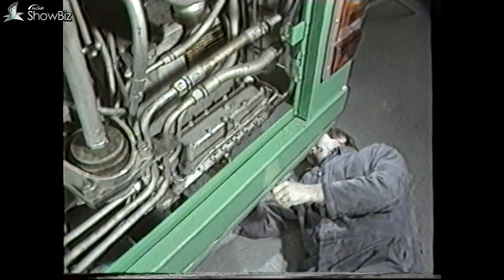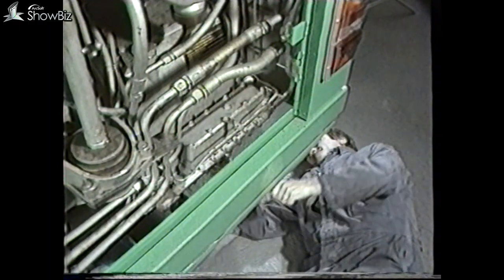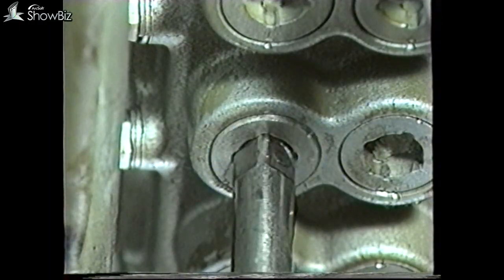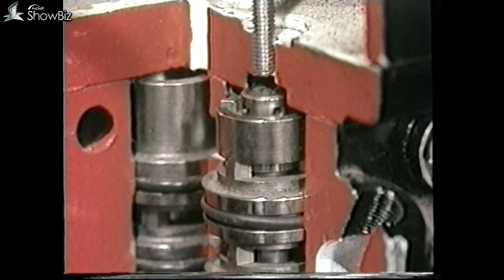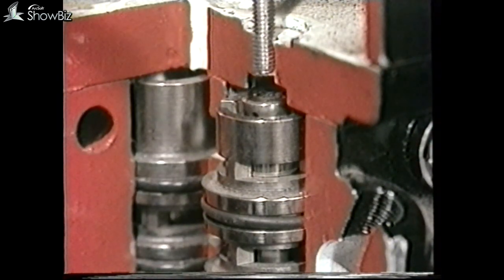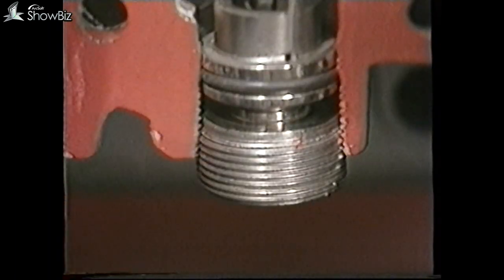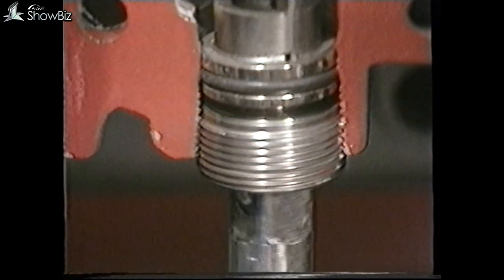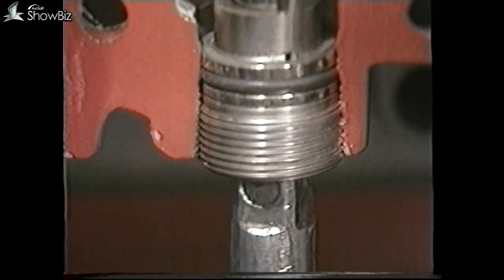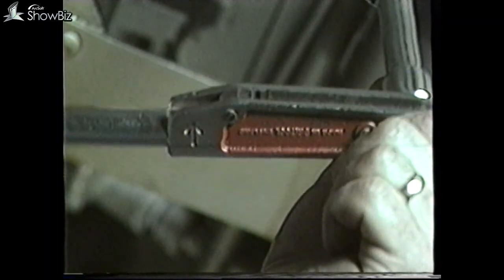If the road conditions are suitable and a higher gear is required, as in the case of long distance recovery, it's possible to unscrew the plug under number three or four solenoid in the EH valve block. This will allow the solenoid plunger to drop and engage that particular gear. As an alternative, remove the solenoid valve and refit upside down — the retaining plug can then be replaced and fully tightened, giving continuous geared application to that gear.